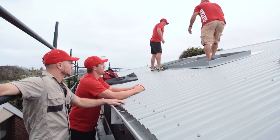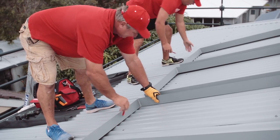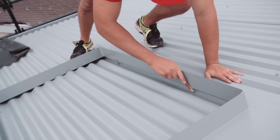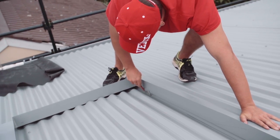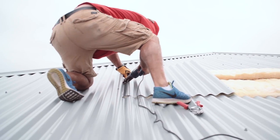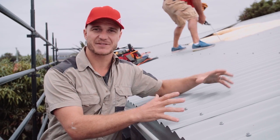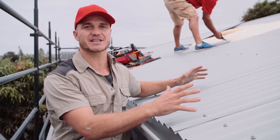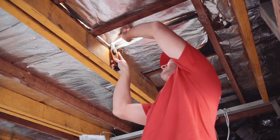So Bodie, what are we up to here? As you can see, the screws that came through from the inside out showed us where our skylight tray's got to go. So we'll clock that straight down so it's in position, we can mark it down so the skylight fits perfectly over the corrugations. The boys have had the custom flashing made up, which makes their job so much easier on the roof, and now that they've marked it out, they're almost finished cutting out the roof sheets.